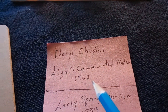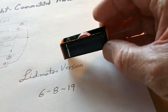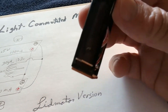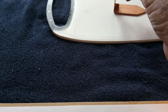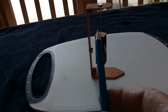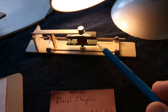This was the first one I built. It's just a sewing machine bobbin filled up with 30-gauge wire, with these two panels that are pretty potent — half a volt, pumping out 100 milliamps — and that was enough to make this work. When you put the light on it just right and shade one side, the thing runs on ambient light. It's a cloudy day here but it runs on ambient light. It's just a needle hung from a magnet, suspended, and it works great.